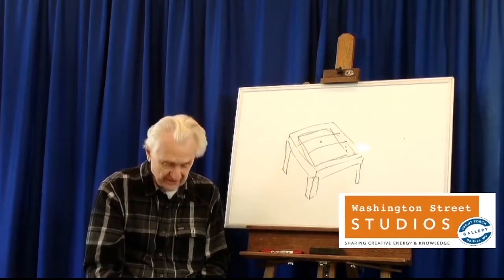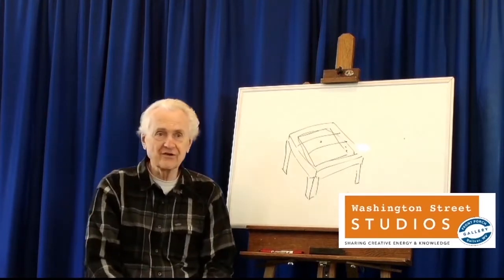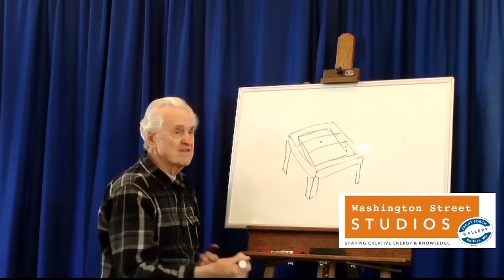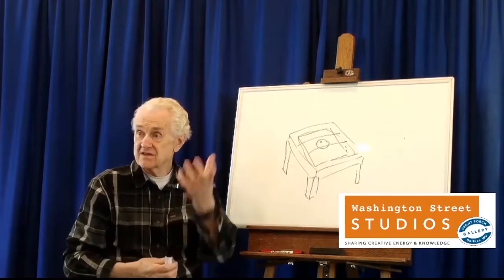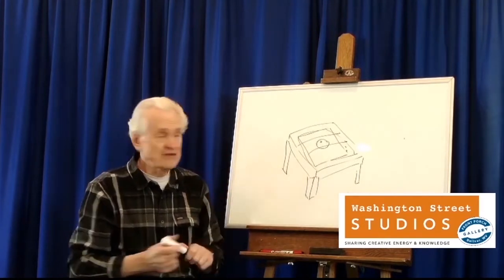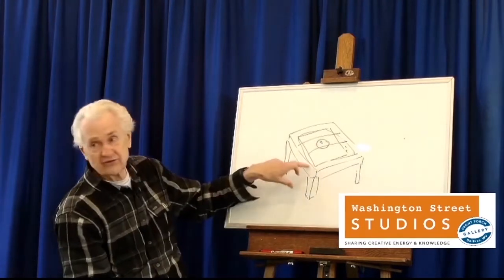So it's worth looking at the kiln stand. Get down on your hands and knees or on the floor and look at it underneath and see whether you have that solid plate. When they make these plates, in some cases now they're making them with a hole in the center to accommodate these exhaust fans. On the older ones, they didn't, but it's really easy to drill the holes in the bottom if you have to. But this solid plate is a really nice feature.